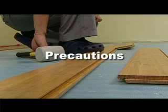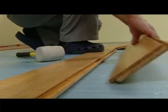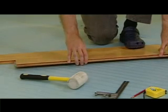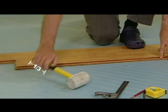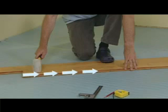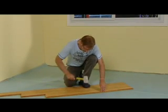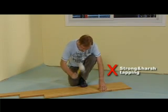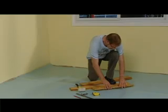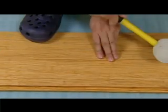Precautions. Whether in case of a direct way or converse installation, please always install as per the following principles. 1. During tapping, it is suggested to hold 1/3 area to the end of the mallet. Don't hold the front area. 2. Tapping always begins from far side to the near side of your body. 3. Tapping with too much force is forbidden, and tapping should start only when the up hook of one panel is fully positioned into the low hook of another panel.